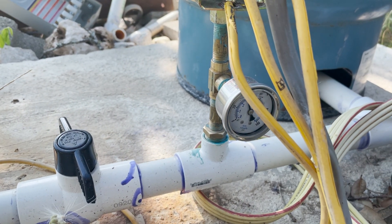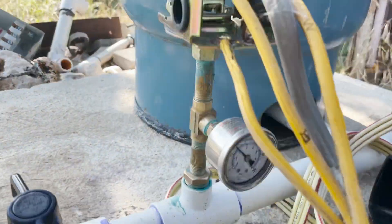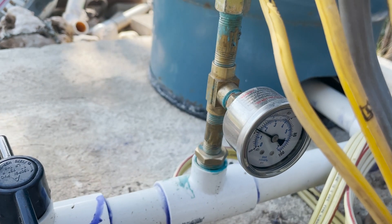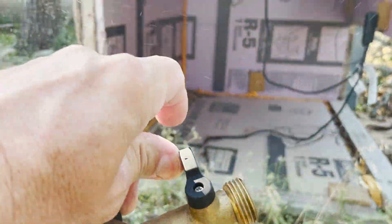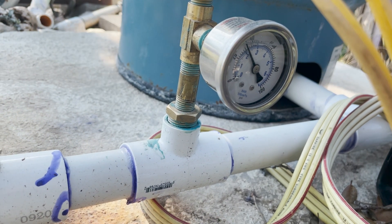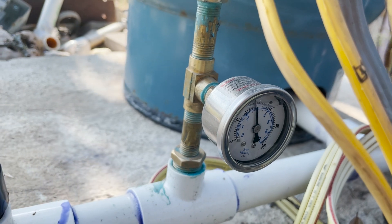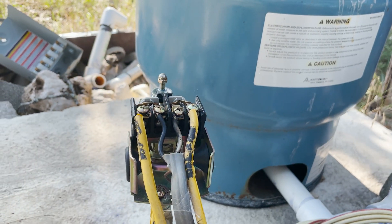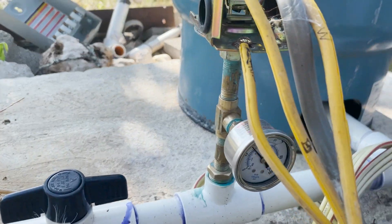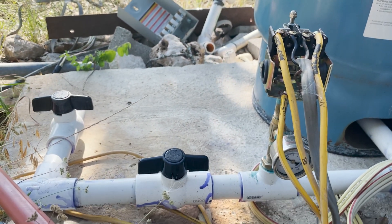We tested it — we have water. Pressure drops, we hear the relay kick on. It may not be able to raise pressure with the valve wide open, but when we turn that off we'll watch the pressure rise. I can hear the pump running — more of feel it in this hose, I can feel the vibration. I see the pressure gauge going up and you can hear it click off. That's the right way — that's the proper method of operation. Turning the valve back on, pressure drops again, pump kicks on — we heard the relay. Now we'll go up to the tank and check if it's filling.